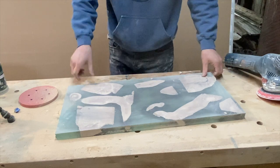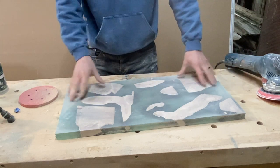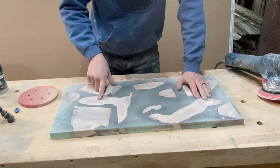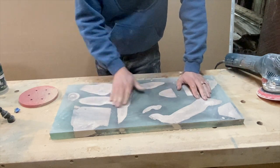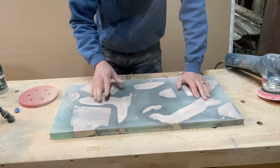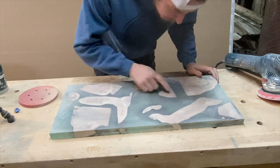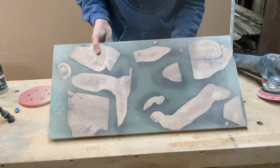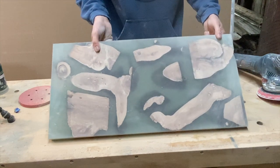At this point we are done with the top. What we're going to continue doing is fill all these holes with some CA glue — these are little holes that were inside the apple wood — and there's one bubble mark that goes down into the epoxy right here that will also fill up.